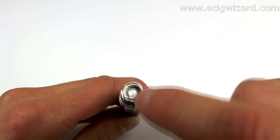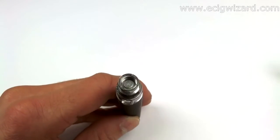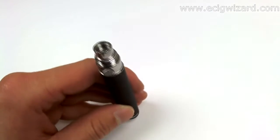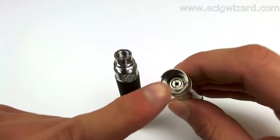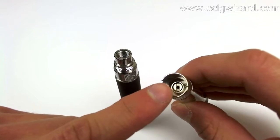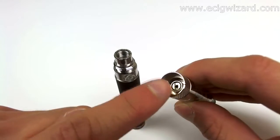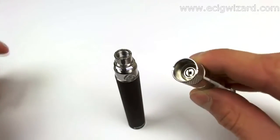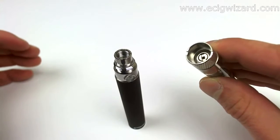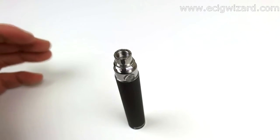The center pin actually can be too low after a week of use, after two weeks, after three weeks, or even after six months. The reason for that is some atomizers have a quite outstanding pin in here. Some batteries have a pin which is a bit lower or a bit more inside, and therefore you can experience these contact issues, unfortunately. And in this video I would like to show you how to fix it.